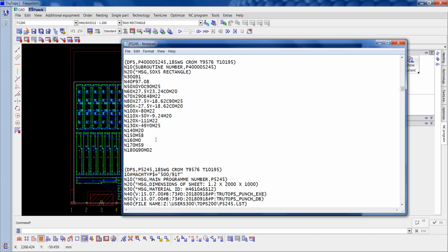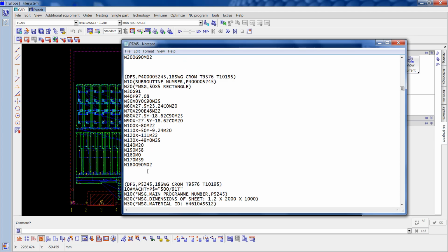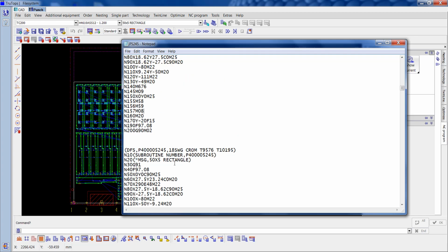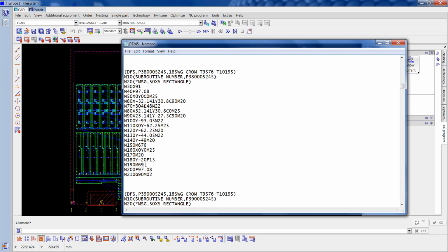That's the manual stop one, so that's the other one now. As you can see, the manual stop one raises the head, there's the stop there, then it lowers the head to normal working height. From a chute job, you'd have the M69 in there, so let's take that M69 out. So after the M67, we drop down a line, N155 M09, and that line after, N165 M58, N166 M59, N167 M08, which would turn the suction back on.